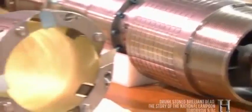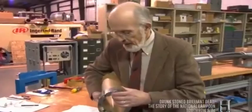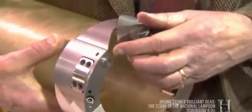To preserve the integrity of the cores, unique ice coring drill bits are used. The idea of a core drilling system is to cut an annulus around a pillar of ice. The cutting is done by these knife blades here, which are sharp, and they act just like a carpenter's plane. As the drill rotates, it cuts down into the ice.